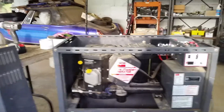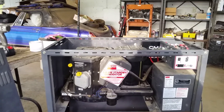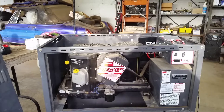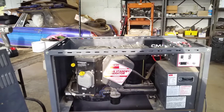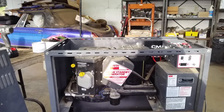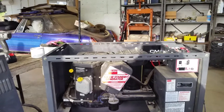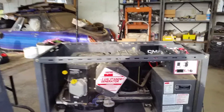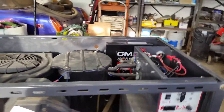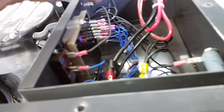This is a whole-house switch that switches the whole house off shore power and onto the generator. This will also run the well, all the refrigeration, and the forced-air heating unit. I've load-tested it before and it handled everything, but it just wasn't acting right — one day it would stay running, the next day it wouldn't. It turned out the volts were just way too low. I also noticed these two wires were loose.